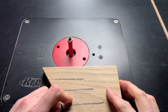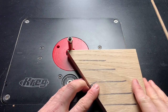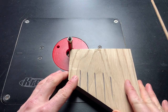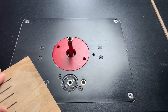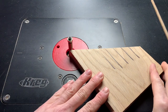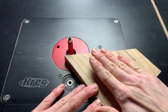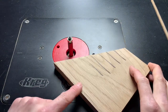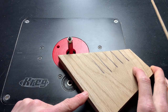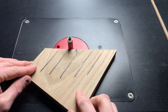Let's take a moment to talk about grain orientation when using flush cut bits. If you're going to cut along the grain, no problem. If you're doing end grain with the grain 90 degrees to the bit, also no problem. Where you run into issues is when your grain is hitting at a steep angle. If the grain is oriented leaning into the cut, it will kick — sometimes split depending on the type of wood — and it can be violent. You can injure yourself or destroy your work piece. Having the grain pointing away from the direction of the cut will result in a clean and safe cut.